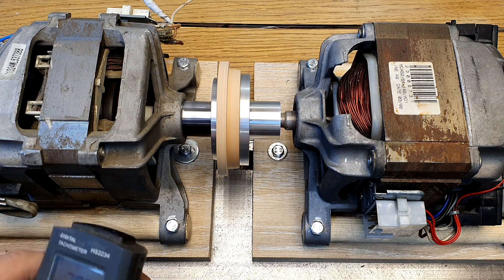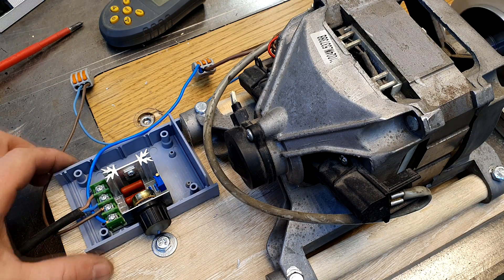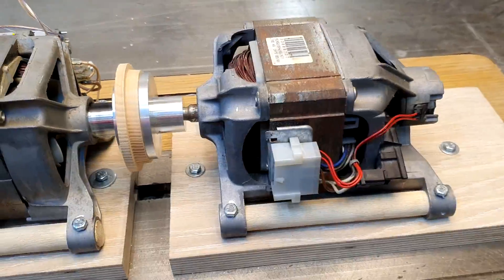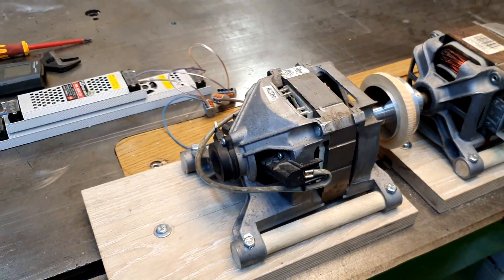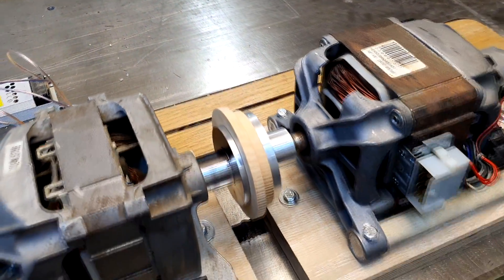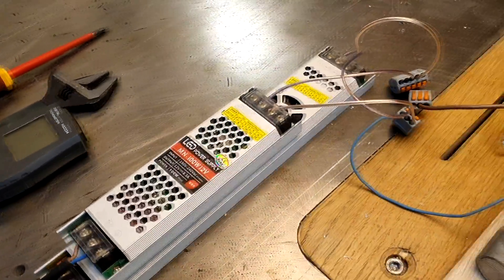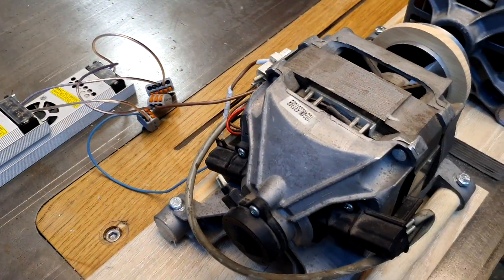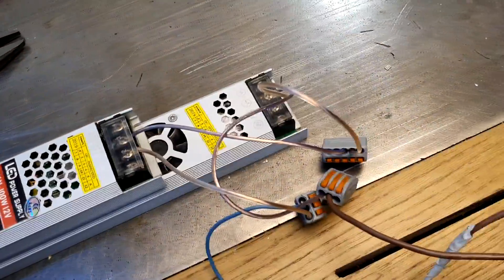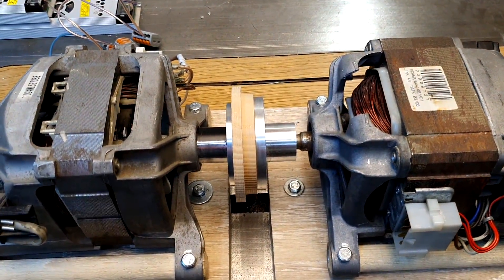This dimmer is completely unsuitable for low RPM operation. I ordered a quality controller on AliExpress with power maintenance at reduced RPM — once it arrives I'll do a detailed review. In the meantime, I found a workaround: any collector motor is designed for DC power, so I connected two power supplies in series, getting 24 volts, and achieved very stable RPM in the range I need.